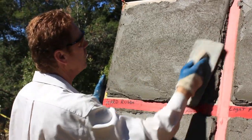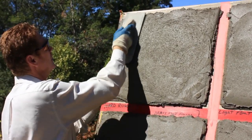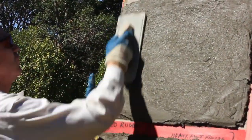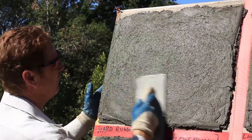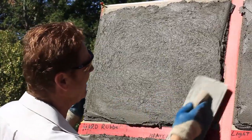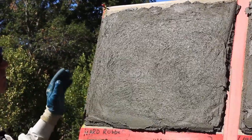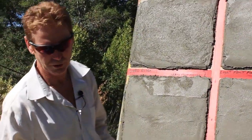I'm going to take the hard rubber float. These are hard rubber, and this is for a two-coat system - we can do an entire wall like this. If we do the entire wall like this, you can still see the grit because you can only float sand so smooth, just like when you trowel it - you can only sand-trowel down so smooth. On interior plaster you can make it pretty smooth, but on exterior you have sand to deal with. Even if you use a finer sand, which tends to crack more, you still have sand. That's what we call a hard rubber exterior two-coat float system.